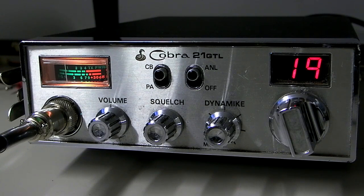Basically, there's four different options. Number one, some radios do have the ability to have talkback already inside the radio, and just to enable it, you have to remove a resistor. Some Galaxy models, some RCI models, etc. If you go inside and remove a resistor, it enables the talkback in the radio. The problem with that is it usually isn't very good quality talkback, it's always on for the most part unless you add a switch into it. So it's not the greatest way to do it, but it is possible on many radios.